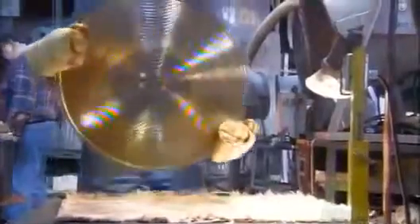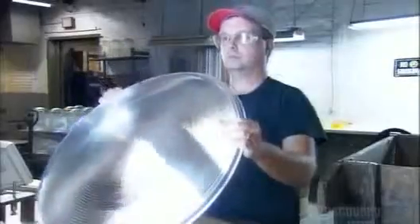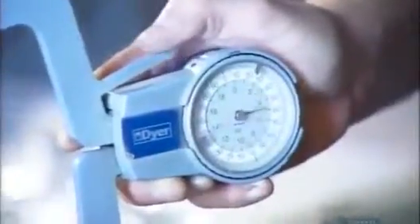Using heat-resistant mitts, workers scrutinize the glass from every angle, checking for small fractures or imperfections in the glass. Next, they inspect for flatness using a paper-thin plastic feeler — if it slides underneath, the lens is warped and unacceptable. They check the glass thickness in many locations using a calibrated thickness gauge. Any major defects, and they discard the lens.